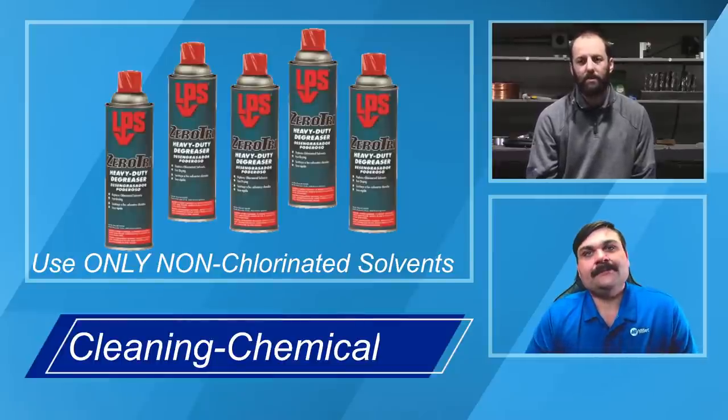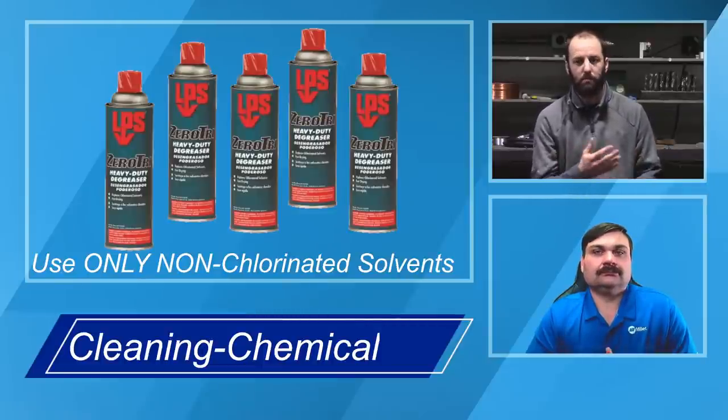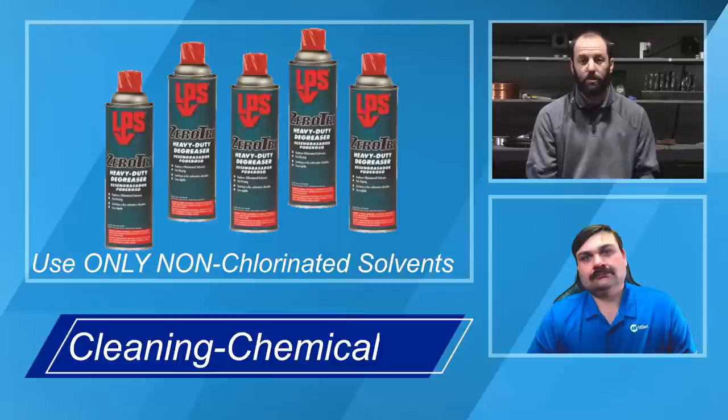Yeah, and in parallel with the solvent that we're going to use, another main factor is that typically you're not just going to be using a solvent, you're going to be using some sort of rag or wipe to clean the material off. That's another factor to consider. Use a clean, dry, lint-free rag in conjunction with the solvent that you're going to be using.